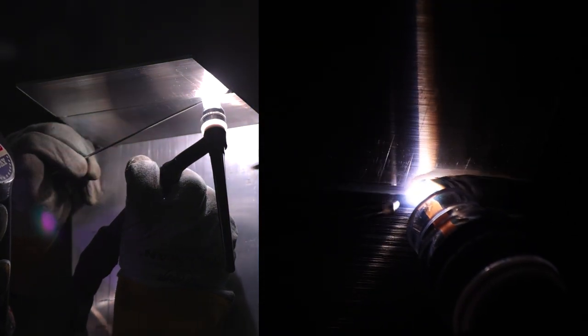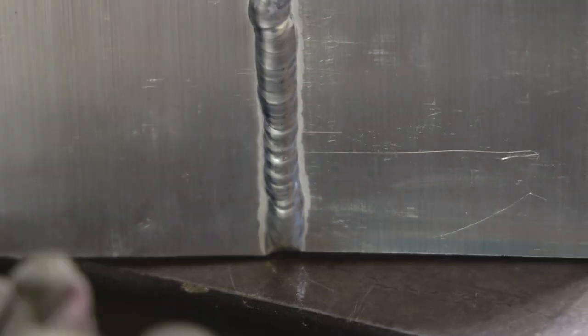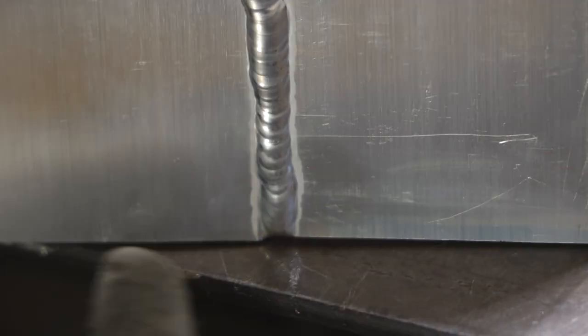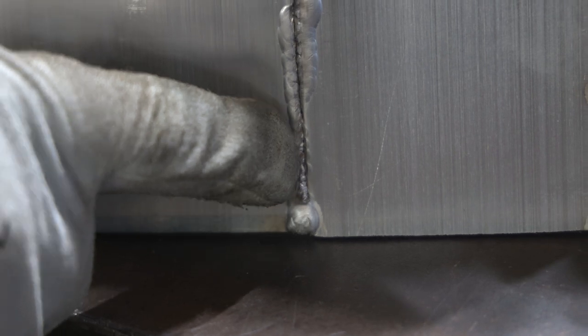So on this first run, I was rolling my tungsten side to side to show proper and improper tungsten angle, and then ended up biasing my tungsten over to one plate. On the back side, my penetration is really inconsistent — lack of fusion, it kind of jumps between plates. Then as I biased to one plate, it got over and I just got penetration on one side. That's what you're looking for — run right down the center, not trying to bias one side or roll your torch to one side or the other. You can see my penetration kind of jumped around inconsistent and then started rolling over to one side once it started to keyhole.